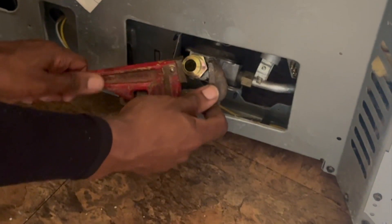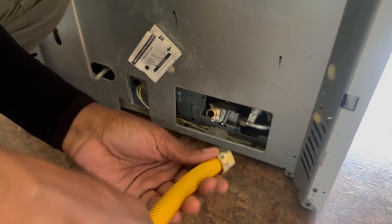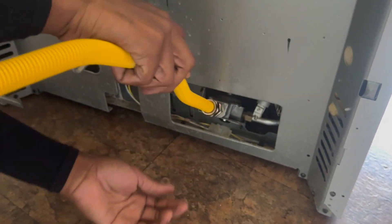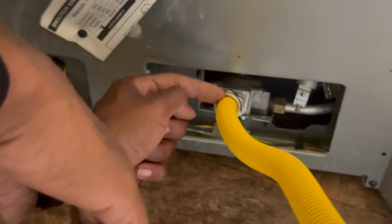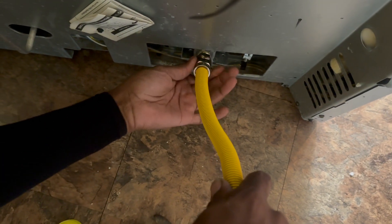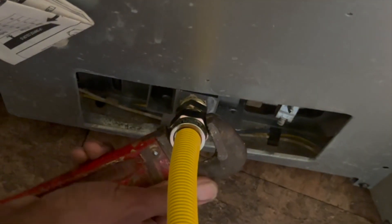Hey Jay, let's make some soapy water — I'll tell y'all what we gonna do with the soapy water when I'm done. So that's on there nice and tight. Then we're gonna take our gas line — remember I'm gonna make sure this line stays straight, the nut is straight on here. Push it on there and then just get to twisting it. See how that's crooked right there? You think that's tight but it's gonna leak. You gotta make sure you pull the gas line back as you're twisting it on. Make sure that boy is tight.